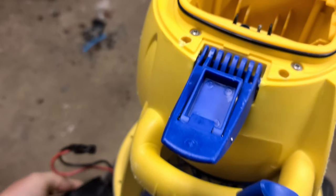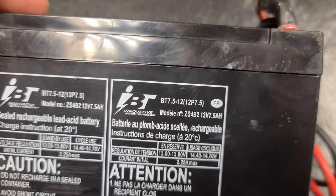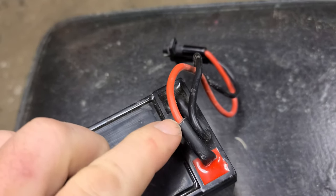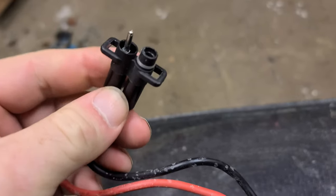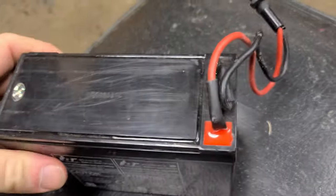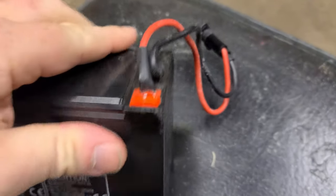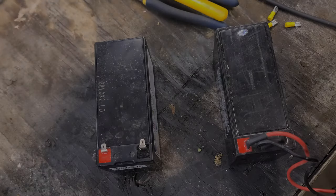We want to have a look at the labeling on this battery — there's a part number: BT7.5-12, and then there's a model number. This battery is put together for this device and what they've done is soldered the terminals to this wire which has this plug — the only plug that fits that socket. A lot of people will pull this out and say okay, we need a new one of these batteries with this plug on it. I'm going to show you how to remove this plug from this battery — we're actually going to cut it off — and then install this cord and plug onto a new replacement battery that's a lot cheaper than buying it from Canadian Tire, CDU, or whoever sells this particular part.